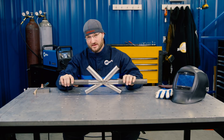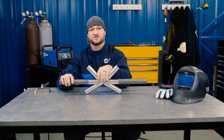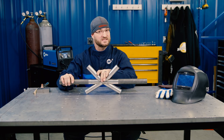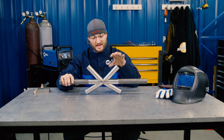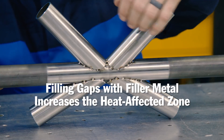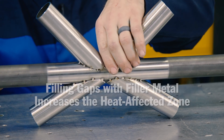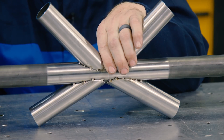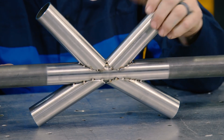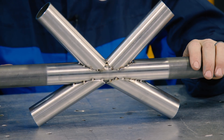As for fitment, if you have a gap at all, you need to close it up. The most I'll use on maybe a 0.095 or 0.120 wall chromoly is a small 1/16th on the lower end. Any kind of gap that you have to fill with filler metal is going to cause a lot more heat-affected zone and it's going to cause it to be more brittle in that spot. Chromoly is already a pretty hard metal, so anytime it's given a chance to be harder, you're exposing yourself to the possibility of cracking. Nice tight copes all the way through, tacks all the way around as small as you can get, and you should be set.